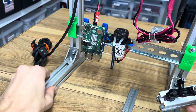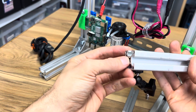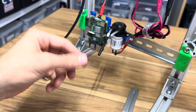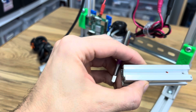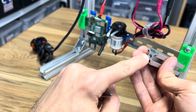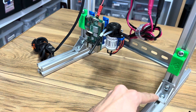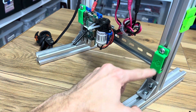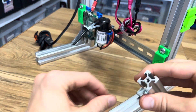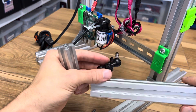These 30-millimeter extrusions have a hole designed in there that's prepared and ready for a size 8-millimeter diameter machine screw. The 20-millimeter extrusions usually have a hole size suitable for M6 or quarter-inch. If you want metric, M6 is the matching thread for most fasteners on the 20-millimeter rail, and quarter-inch is the same as most mounting equipment for cameras and brackets.